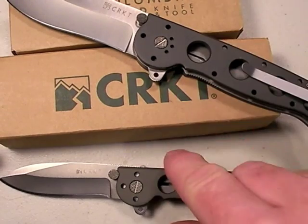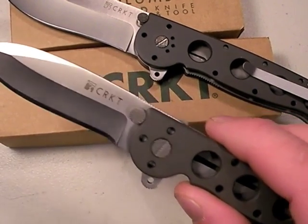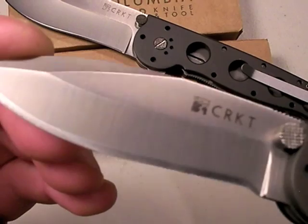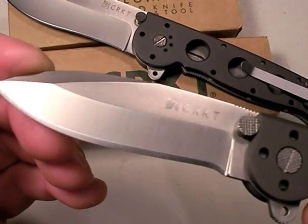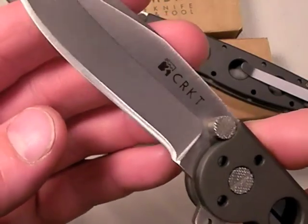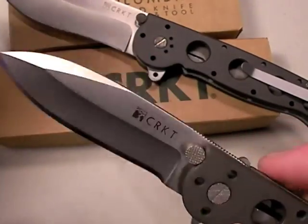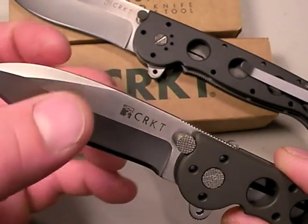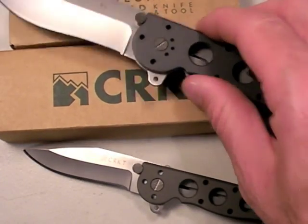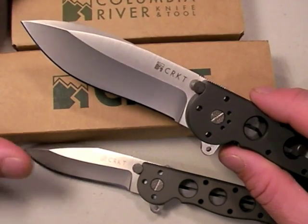The original one, and this is my knife, this smaller one, the 02 version, I had resharpened because I wanted to make that relief edge a little more gradual. I had my friends at Razor's Edge perform the work for me. You can do that on a Lansky sharpener, or any number of resharpening devices, no problem. That's just my own modification I do on several blades, because I feel like it's kind of a steep grind. Going back to my preferences, I generally like that full flat grind. The gradual approach to the relief edge makes it a better slicer, better cutter.